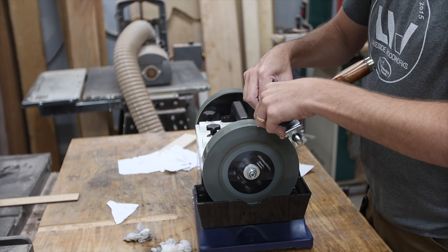When talking about direction with the strop, you definitely want to go away from you because you don't want to come toward yourself with the chisel and catch into the strop — you'll ruin it. So we're going to take care of the burr first on the back, just placing it on here. You can actually see it kind of rolled over. We're just going to keep doing this until we can get rid of it and polish that back edge. That burr is gone — now polish this edge.